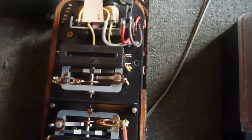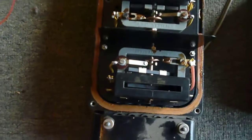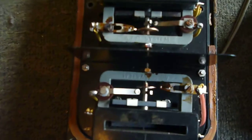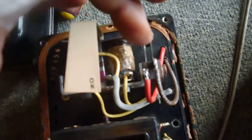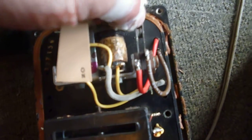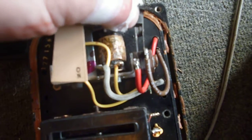Inside the 1950s version, which is the Rhythmatic Receivers, you've got two pendulums. You've got a set of contacts on each pendulum located here, and when these things close they operate these coils, which will then pull the switch to the open or close position. You've got the contacts right there — you can see them opening and closing.